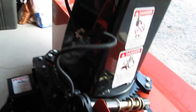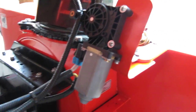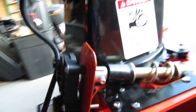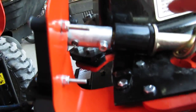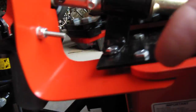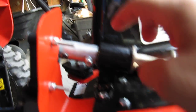I also used a window motor right here. The window motor is this silver piece and this black piece here. I came over here — this is the original shaft that was on here — and I took this little coupler and attached it onto the motor. I also made this orange bracket here, painted it orange to match the tractor. This right here rotates around, spins this on the gears, and the whole thing rotates.